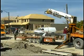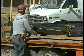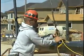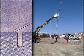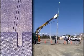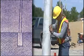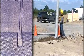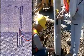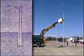Now the pole is ready to be installed. Using a nylon sling, choke the pole 20 to 25% of its length down from the tip and attach the lifting hook to the sling loop. Lift the pole smoothly to near vertical, allowing the butt to rest on the ground. Then lift the pole until the butt just clears the ground and position it over the hole. Lower the pole into the hole smoothly until the butt rests centered at the bottom of the hole. As the pole is lowered, the power cables should be guided through the aperture.